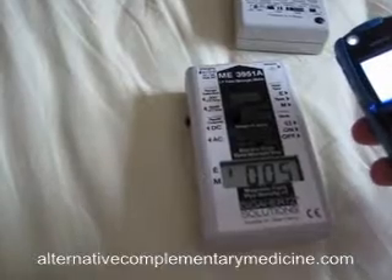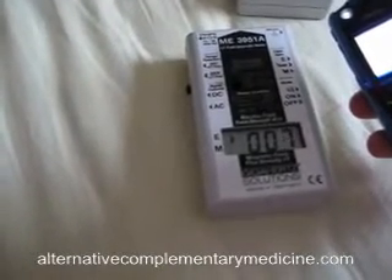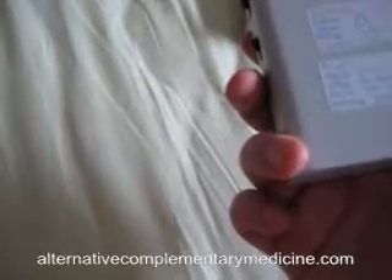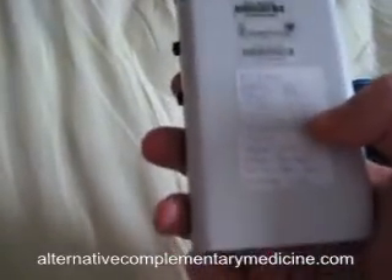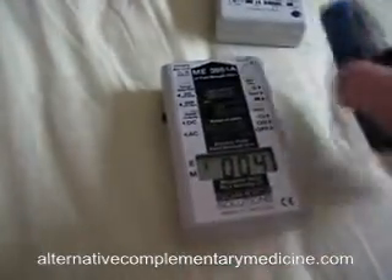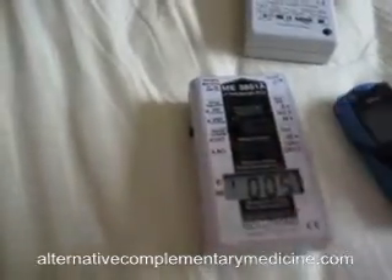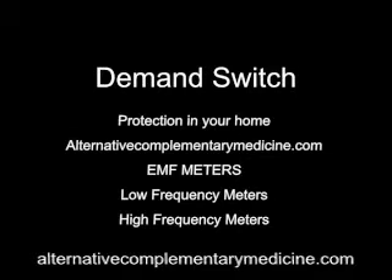Let's do it again — 24, 20, 30. This is a strong electric field. Strong electric field is classified from 5 to 50 volts per meter, so it falls in that range. It's not extreme though — it's above 50 only briefly. On average it shows like 2 to 4. Only when it connects is the level higher, so 2 to 4 is still a weak electric field.